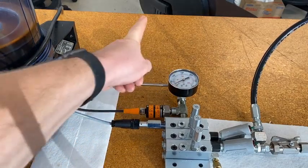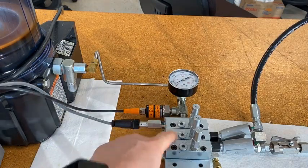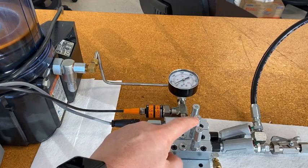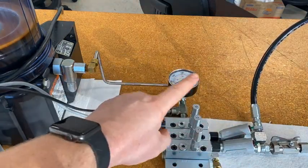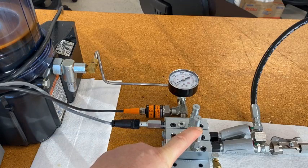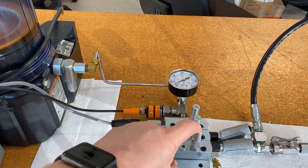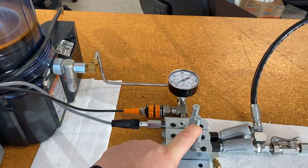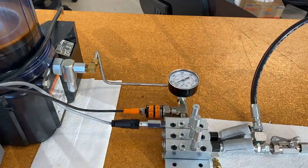Then we have a pressure gauge for visual indication, a pressure switch, a cycle switch, and this is our MSP valve. This MSP valve also has performance indicators. If you're going to spend the time and money on broken line indicators, you should go all out and get the high pressure performance indicators too. These are really key to let you know when you have a high pressure fault what the actual issue is. If you don't have these, you may be really confused if you actually have a blockage and not a breakage. These are pretty important to use along with the BLI, but ultimately they're optional.